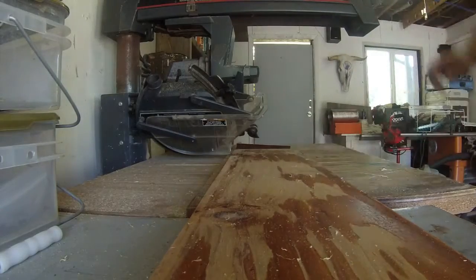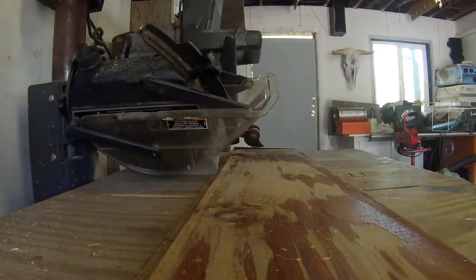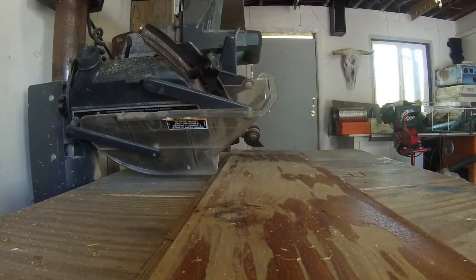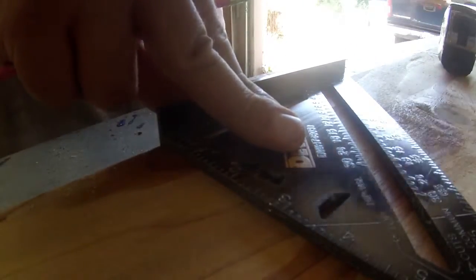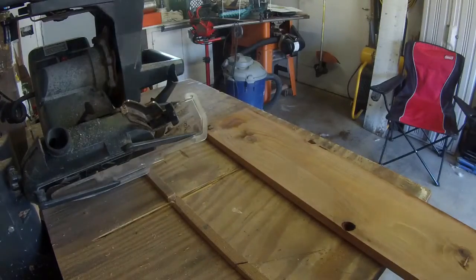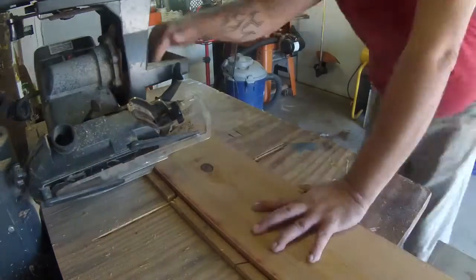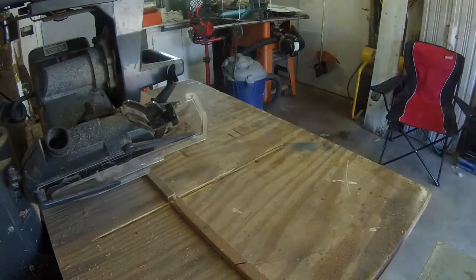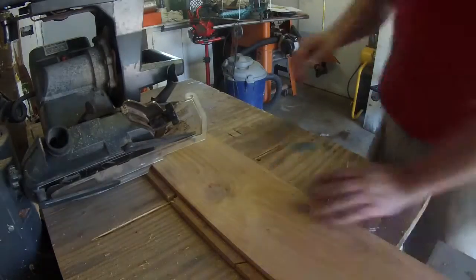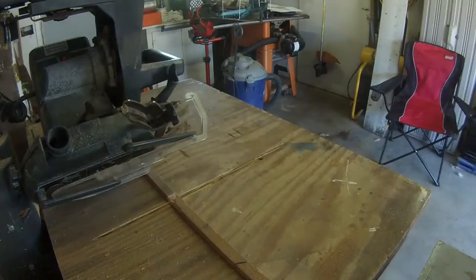Okay, so I'm using 8-foot length 1x8 cedar boards. The planter boxes are going to be approximately 3 feet by 5 feet, slightly smaller because of the bevel edges that I'm putting on. I first start off with the bevel edge on one side. I mark out my 3 foot, make a mark, flip it over, and put the bevel on the other side. You want to make sure you do an opposite bevel so the bevels are facing inwards. After that, I will do the same thing to the second piece, which is almost 8 feet in length. Cut a bevel on both sides facing inwards.